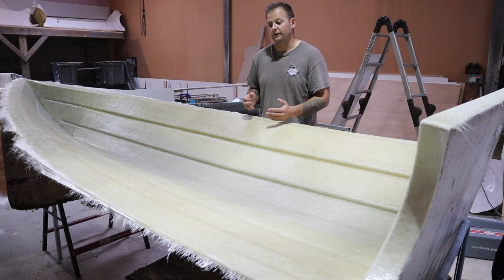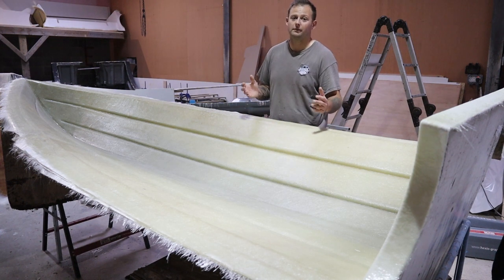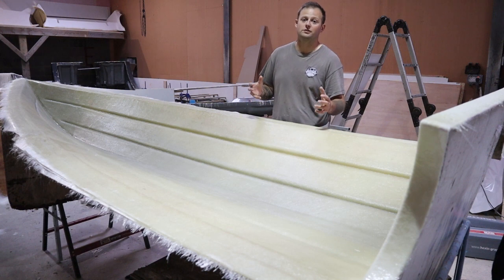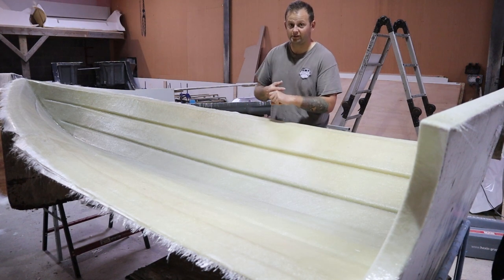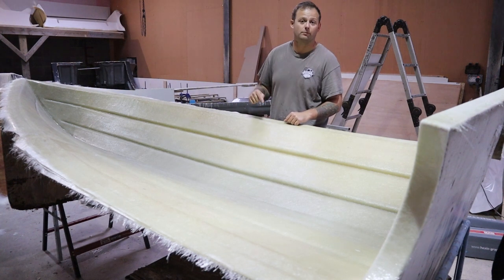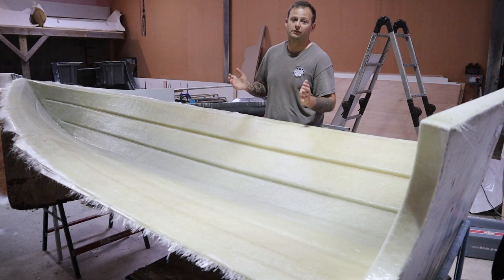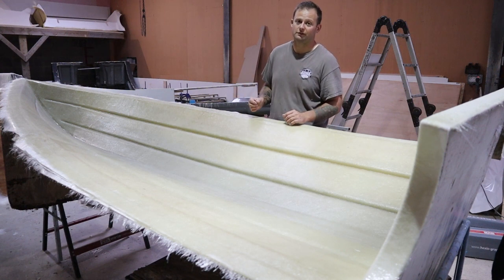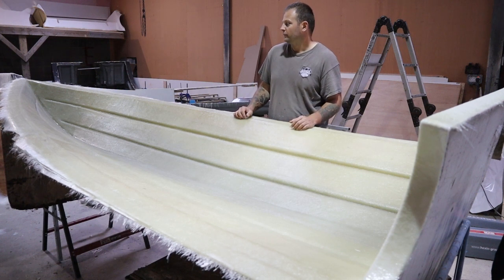There is a fourth one that we don't really get over here, which is Coosa board. The Americans and the Australians use something called Coosa board, which is a fiberglass composite board that can be drilled, it can be tapped, it's as dense as timber, and you can sink this baby to the bottom, refloat it, and sail away with no issues. There's never going to be any rot going into that transom because it's a pure composite fiberglass board.